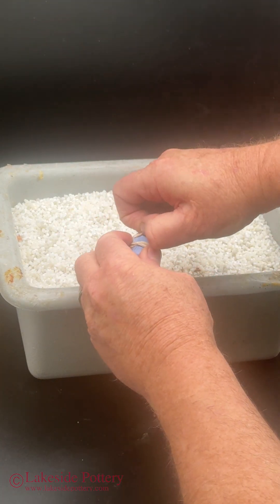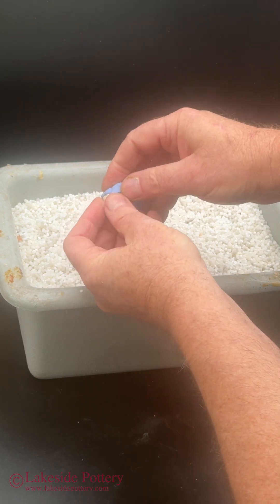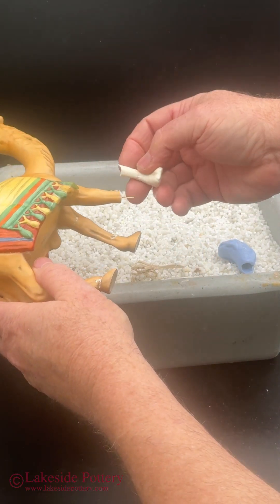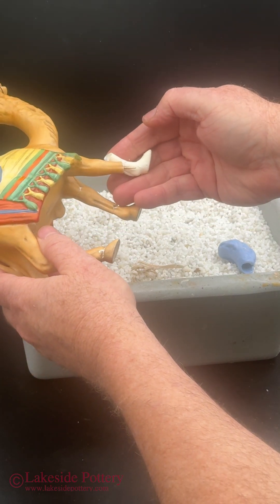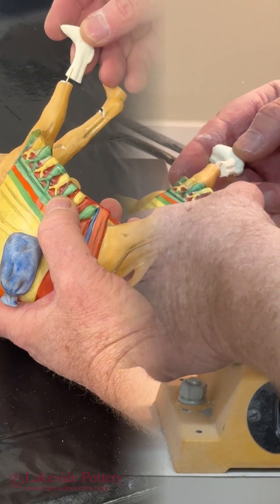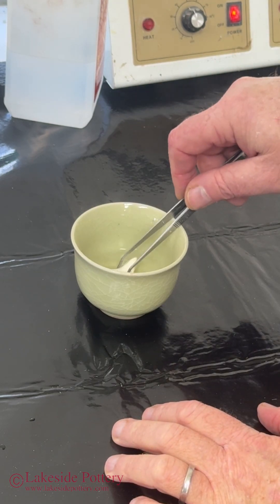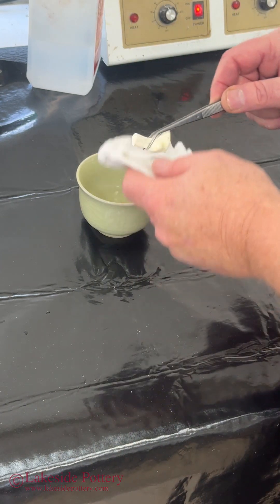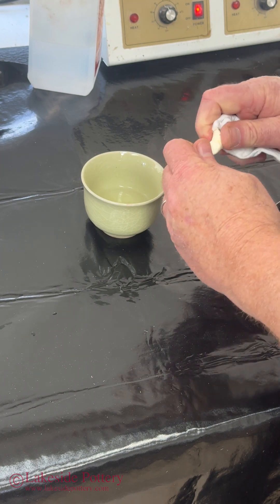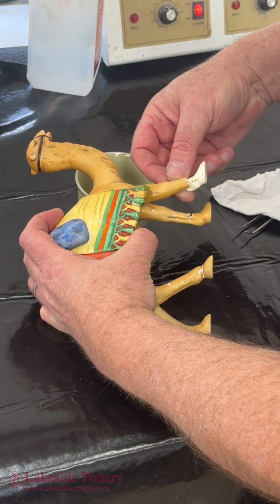I'm removing it from the mold, then I would check it and see what it looks like as far as length and angle. See, it's too long and it's off angle — it's not straight. I'm going to grind it off. The angle is off, and I'm using hot water. The hot water works only if you do it within 15 minutes after you've taken off the mold — it still has some flexibility, otherwise it's too hard. So I'm taking advantage of the time and bending it to be correct. I run it under cold water to keep it the way I bent it. And then you can see all the legs are lined up in a straight line — it would sit straight.